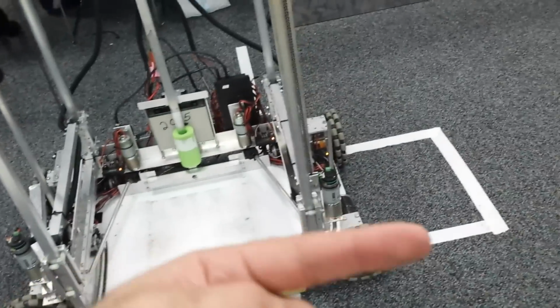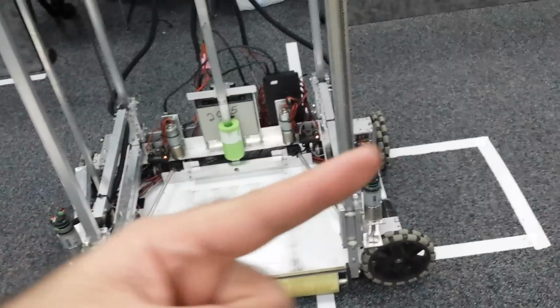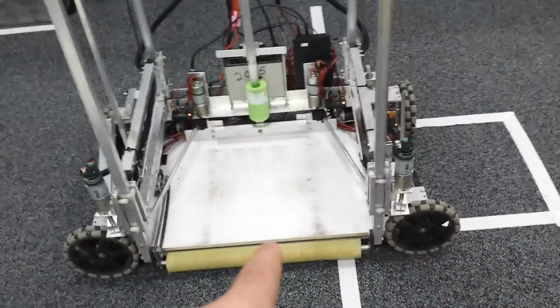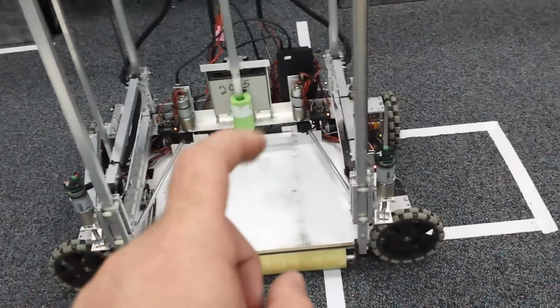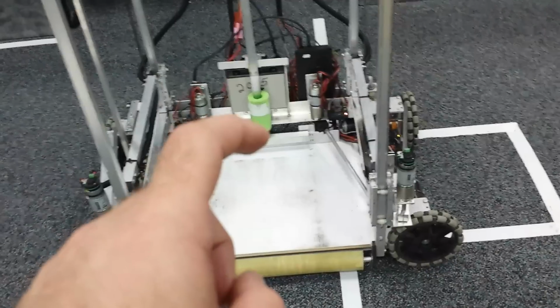So when you go this way, with resistance counteracting it this way, the robot's going to have a tendency to want to turn continuously like that around the application of force. The resistance is here, the force is here, it'll rotate somewhere between there. Now, you can actually compensate for this either with a hard value or with a PID active feedback control system.